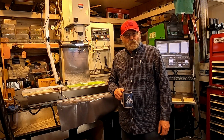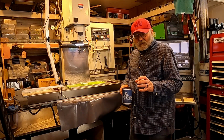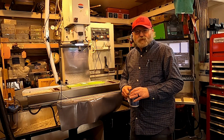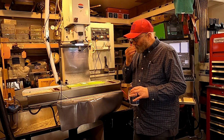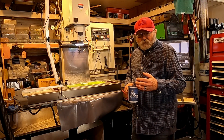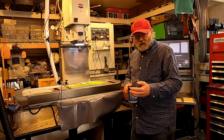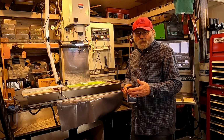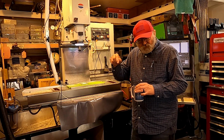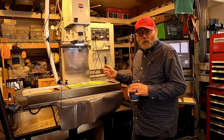Anyway, I've been working on it. The machine ran most of yesterday. This is a pretty small design. And since I was able to create it from scratch in Fusion 360, it's a pretty efficient design to cut. I've learned that when you start out with a file that was originally a graphic that you converted to DXF and then converted to 3D, there's a whole bunch of extraneous operation moves that do nearly nothing, but it wants to cut in between each one of the spline connections. And it takes a long time to do that. This one is much more efficient.